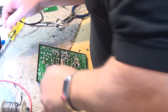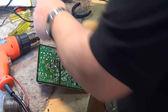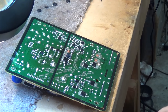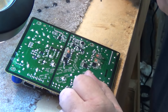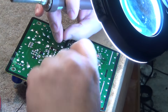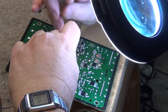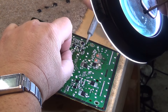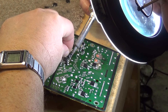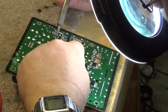So we have the four transistors here. We're going to mount the transistors and then change the IC and put the board back in the television. I can attach the transistors by conventional method just using an iron and solder — I don't need to use the heat gun to replace the transistors, as I just need to solder the leads in place and solder the backs of them down.